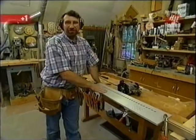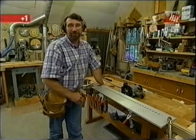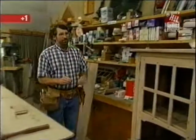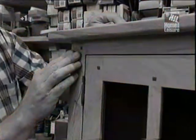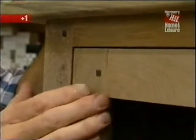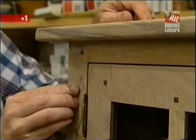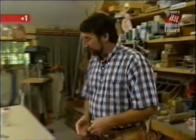After finishing the holes in all four posts, it's time for a little sanding. I've started by making mortises for the decorative ironwood pegs — the original had pegs at the intersections of the carcass and at all intersections of the door. I have to make the mortise for the pegs on the front of this post now, because once the side is assembled I can't fit it into my mortiser.